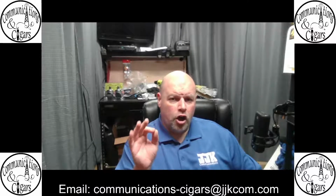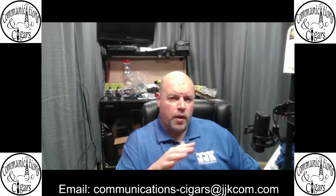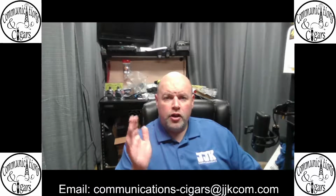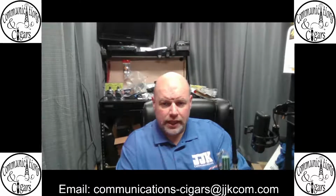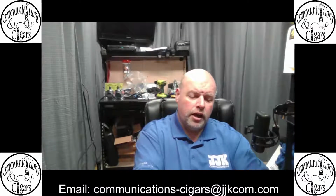Because when you're using a COS, carrier operated squelch, that's kind of where it comes from, from the packet days. And then carrier operated relay, which basically is what this is right here. You're going to have better success with that, because once it sees the actual sense, that hey, there's a ground sense here, it keys up the radio, and you'll have a better time doing that.